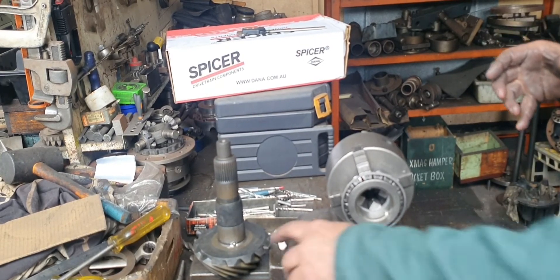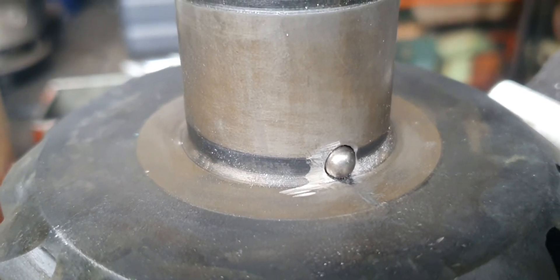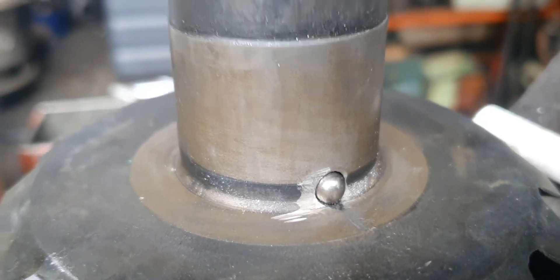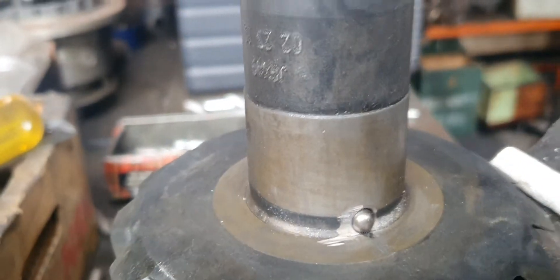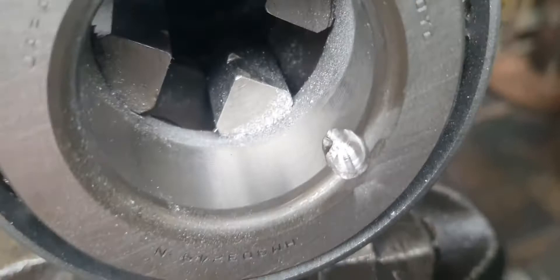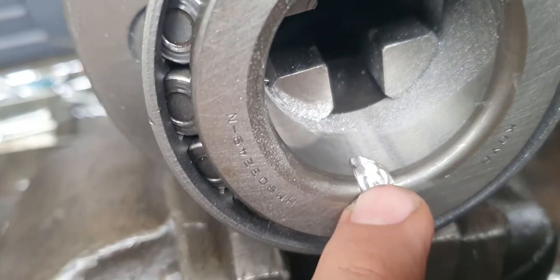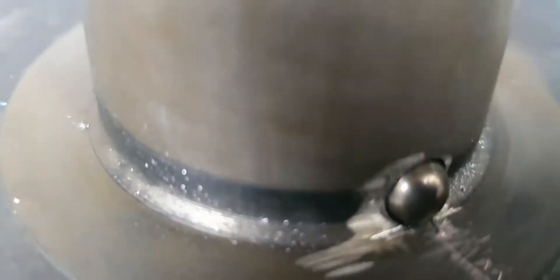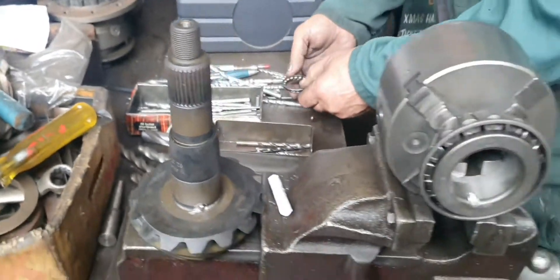So let the Scotch key stop the bearing from rotating, skidding around, because this diameter has been ground too small — it's only half a thou interference fit. You've got a ball going in there, and it doesn't rotate. There's a quarter-inch one here. That's how you fix stuff up that's brand new and faulty.